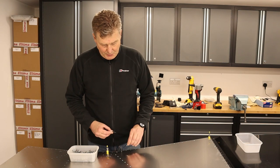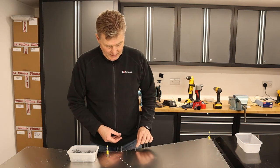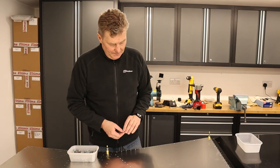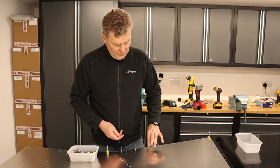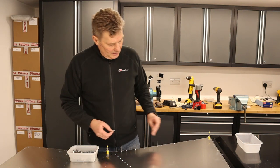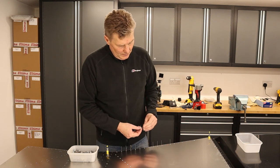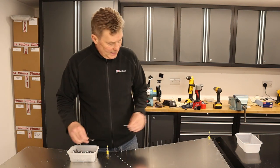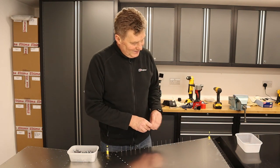So as you can see, the process is, we just put a handful of skin pins down first to make sure the actual panel aligns perfectly. Then we put several pop rivets around the circumference of the panel, again, making sure everything aligns. And then I'm just placing in the rivets here on each run, and then we'll go along with my golden riveting gun.